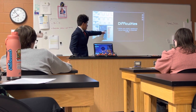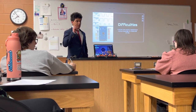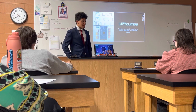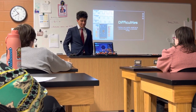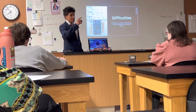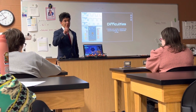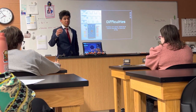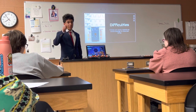The main issue I ran into was that I had only a select number of these pins — pins 2 through 13 — and that was not enough because I had 4 motors, which would require 16 pins, and that's not enough. I tried solving this by programming it into the Arduino code, but that did not work, so I ended up simply inverting the motors. If you have a motor going from pin 1 to pin 4, the other motor going the opposite direction would go 4, 3, 2, 1 instead.